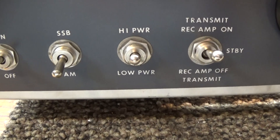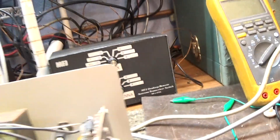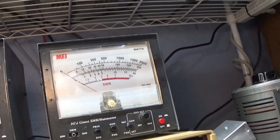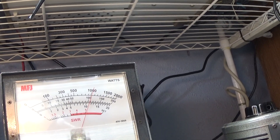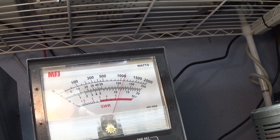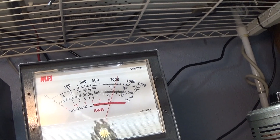It does about 100 watts on the low side, 150 on the high side. I've got it already tuned up on the high side so we're just going to hit it quick. We're only putting in a couple watts, swinging to about eight into it — not putting a whole lot into this amp. On my MFJ giant wattmeter on the 200-watt scale, let's turn it on. That's about 110 watts.